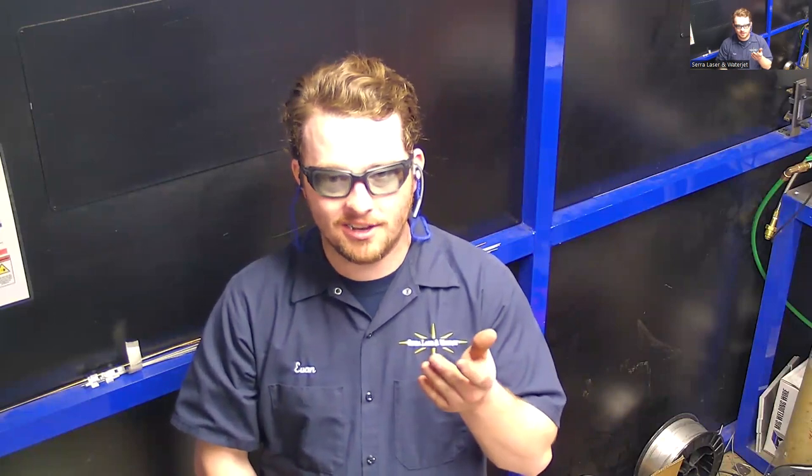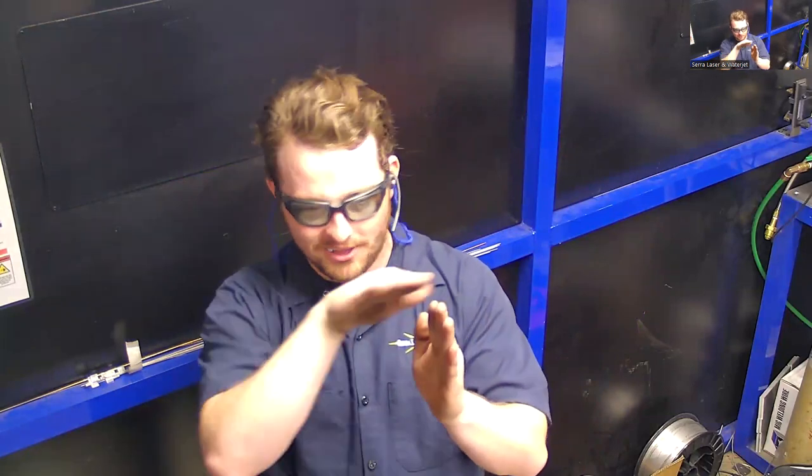If the fillet size is not a problem for you, you just want to make it welded up and filled nicely, 0.045 is going to work good. The 0.045, as you saw in your part, practically filled that gap. I just had to cover it one more time. With 0.030 wire, you might have to do some more manipulation to fill a gap. Really, the most useful part of the wire in this case is that it can physically bridge a small gap so that the laser doesn't just shine through the gap. So it physically creates a cover, and then the laser blends it all together.